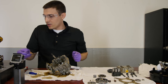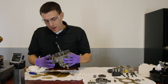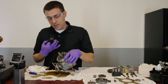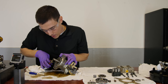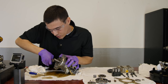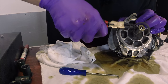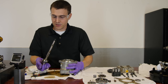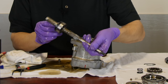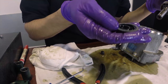Up until this point, this pump could be serviced while still in most machines — you can take the head off and replace this gasket. There's a gasket set with all the seals and gaskets in the pump. This top seal could be replaced while the pump's still in the machine. There's also a bottom seal and a side seal here on the side of the shaft. If the bottom seal were to blow out or be worn, you can replace it, though in most machines it's pretty hard to get to. The advantages of doing it in the machine — the cleanliness — can really pay off. If the seal is worn, you want to check that the bearing is in shape, since a worn bearing can lead to seal failure.